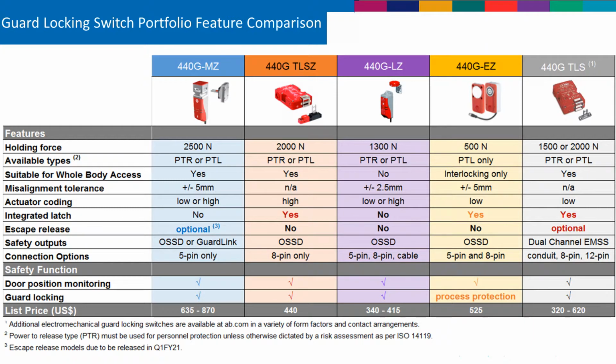So you have to be cognizant of how the machine could shut down, or if it loses power, that maybe the doors may open up because of the power to lock version only. The second thing that the risk assessment should tell you is the performance level or category rating that you need to attain for your safety circuit.